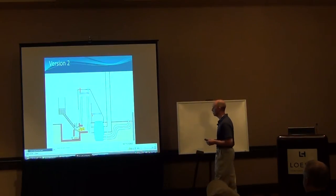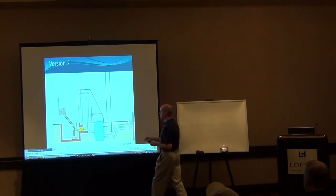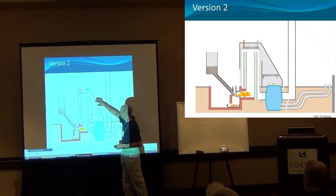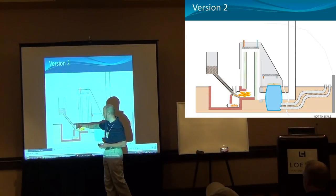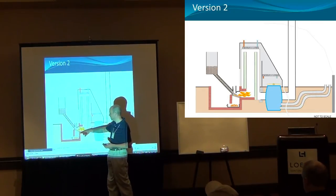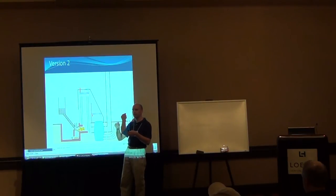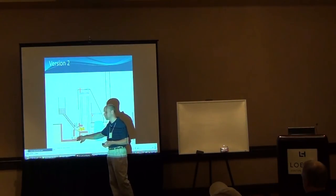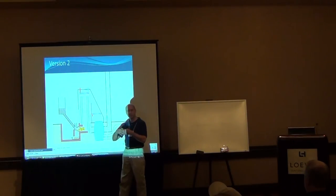So here's the diagram of what I call the rocket mass heater on steroids. If you ever saw that video, this was the typical rocket mass heater here, and then this is the cover that I put over it. So here's the pellet feeder and a little diagram of how the pellets come across on this grate. They basically burn through and then into the ash that's created. As the pellets are sliding over that grate, they self-clean because you have that movement where the new pellets coming in actually break up any of the, we call them clinkers, any of the chunks that really haven't burned. It sort of pushes them through this grate and then they fall down into this ash pan. And the nice thing about that is if any of those pellets haven't been consumed completely yet, they still keep smoldering away in here and they actually will keep smoking.